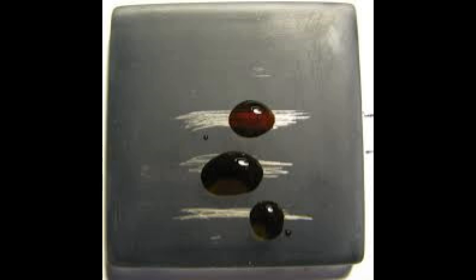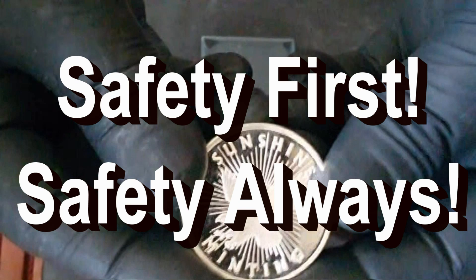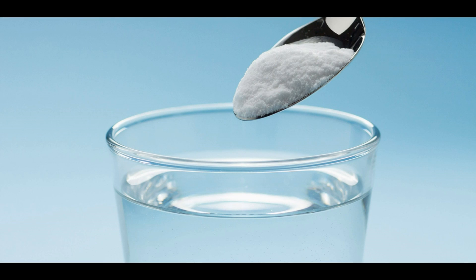Once the rub samples are on the slate, take the test solution bottle and apply a single drop to the rub. Allow 10 to 20 seconds for the reaction to take place, then blot or wipe the test with a white paper towel or tissue and observe the color left behind. If the item has at least 50% silver content, there will be a color residue left on the wipe. This type of testing involves the use of nitric and usually muriatic acid, so precautions should be taken to protect any exposed skin and your eyes. Always follow the manufacturer's directions for proper care, storage, and handling of acids. Having a solution of baking soda and water nearby as a neutralizer is also a good idea.